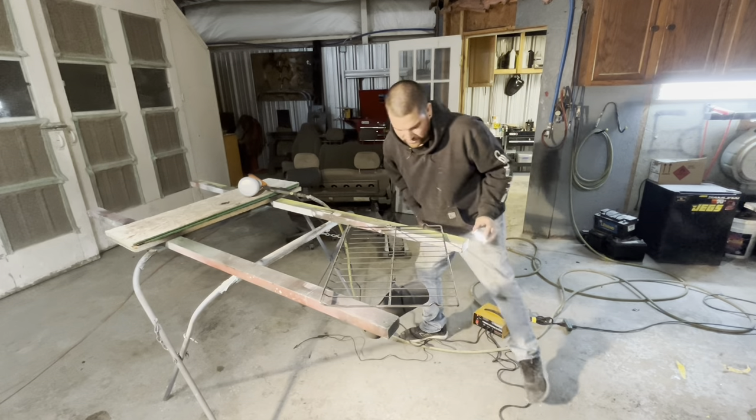Let's get the clamp off and put this thing in the oven. There she is — in my house oven. Okay, rule of thumb: if you Google it, you can bake powder coat at 350 to 400 degrees Fahrenheit anywhere from 10 to 20 minutes. So we're going to go 400 degrees, 10 minutes, maybe a little past 10. It needs to almost glass over — the heat is melting the powder and bonding it to the metal. So when it looks like it's melted out, it's good. We'll check it in 10 minutes.